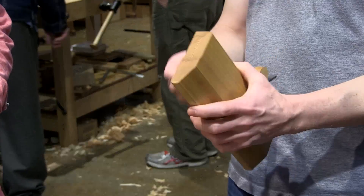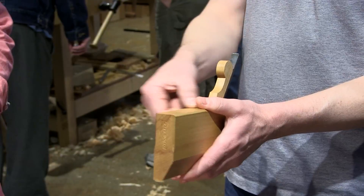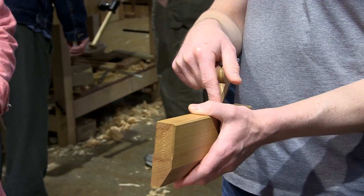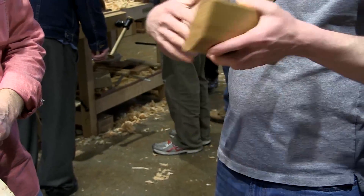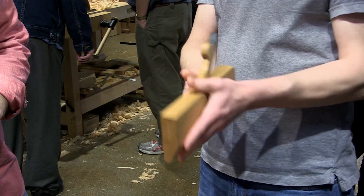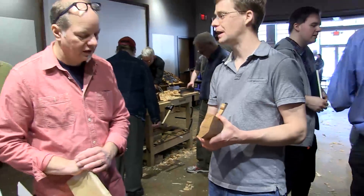On the British style, they had a rebate cut here, and the grip was over here. On the larger planes, that rebate material would become your wedge material, so it wasn't wasted. It also allowed them to use a narrower plane because it had support — it wasn't open on the side, so it wasn't as susceptible to warping. You can use less material. It all seems to be based around doing this professionally and making tools in a production way to save material.